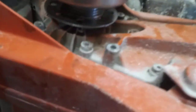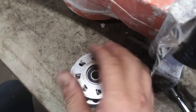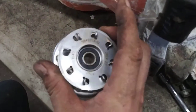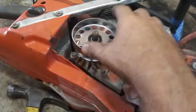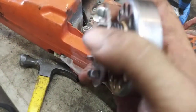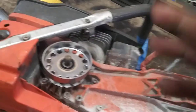Okay, that's not right — I'm going to take it back off. So this aftermarket — actually this is OEM, it's the only one I could find — but it's got a little nodule sticking up in here and stopping it. So we're going to take this back off and see what's going on. The old one didn't have this, so I'm going to grind it off because I don't want to damage it. These are not cheap — 40, 50, 60 bucks, it'll be in the description below. So I just ground it right down — now it spins fine. This must be some kind of upgrade, possibly for heat dissipation. They did it for a reason — this is an OEM part from Husqvarna. Now we're ready to put this thing back together.